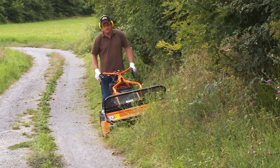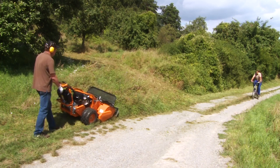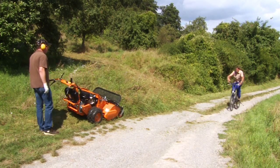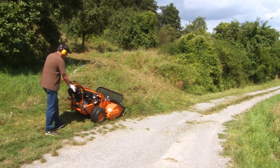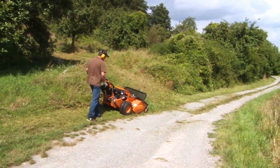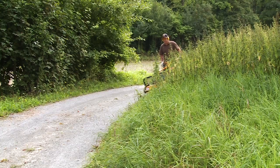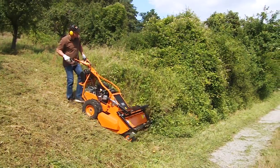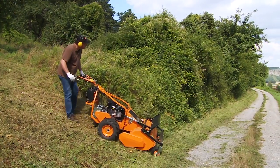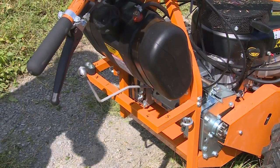You should only mow dry grass and only in good daylight to mow safely. Be alert to everything in the area where you are mowing, including passers-by who might enter the area — should someone come into the area, stop. Keep a close eye out for uneven ground, holes, or roots that may result in loss of control or the tipping of your mower. Maintain a slow speed while turning a corner where visibility is limited, or approaching trees, shrubbery, or any other obstacle that may hinder your visibility. Children, pets, or other hidden obstacles may not be noticed, so always be ready to bring your machine to a stop. Pay attention to the fifth and highest gear as it is not intended for mowing, rather for transport purposes with inactive flails.